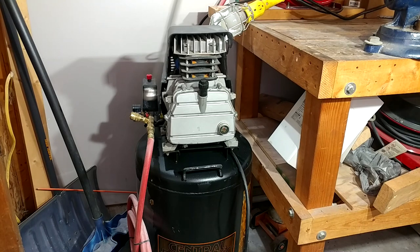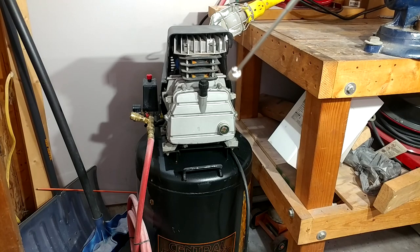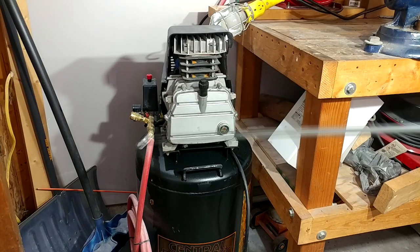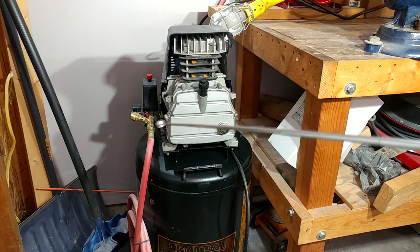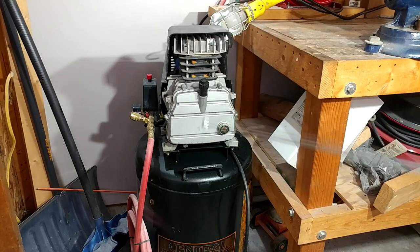But in reality I think it was saying like 160 psi, which is bad. This thing's only supposed to be good for about 125. And the emergency blow-off valve on the tank never popped, which is also bad if that's truly what's going on. So that is the reason we've got this really bad camera angle right now where you can't see anything I'm actually talking about. I don't want to actually touch it until I verify what's going on, because if that pressure switch I replaced is stuck in the always-on position and won't fire off, I don't want to bounce this thing around. So I want to know if we have a repeatable condition here, and I'm going to add some additional safety features because that valve on it didn't blow off.